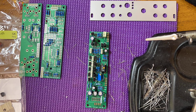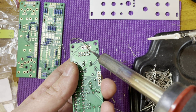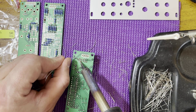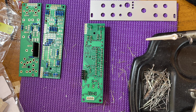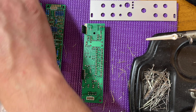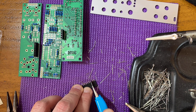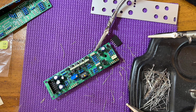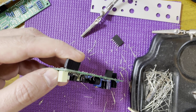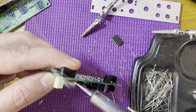Make sure to orient the power header slot away from the PCB edge. I used my snake charmer technique on this one so I could hold it on straight while soldering the first pin. Moving on, let's install the female headers. You have to cut them from the strip that comes in the kit. Count the pins you want and cut the very next one — you will always lose a pin with any cut, so purposely cutting the one right after the number you want ensures you have the right size header. Solder just one pin on each one, then use your fingers to push them flush to the PCB while reflowing the soldered pad. This will ensure they sit perfectly perpendicular to the PCB.